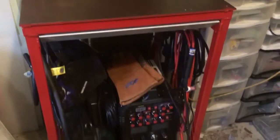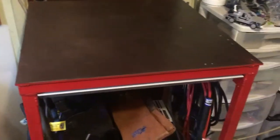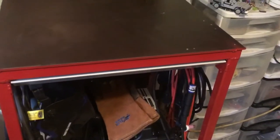Let me turn the cart around, and I'll show you a few other things on the other sides. Oh, and one other thing on the top. I drilled and tapped some holes, 1/4 inch, 20 threads. These bolt spacings are for a bench grinder, and those two will hold a small vise that I have, holding it this way, or those two holding the vise that way. And I've got one more here to hold down my arbor press, so I can put a few tools on here. I'll probably drill and tap some other holes on the other corners for other stuff as well, but for now, that works fine. So let me spin this thing around.